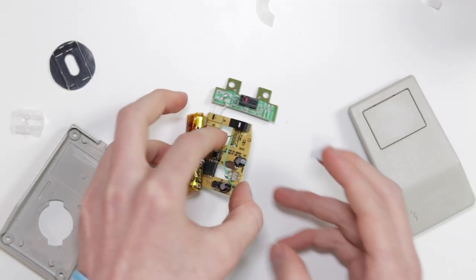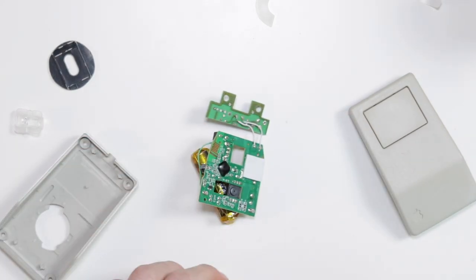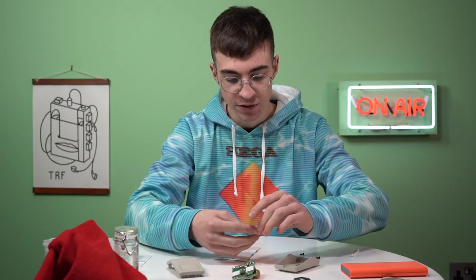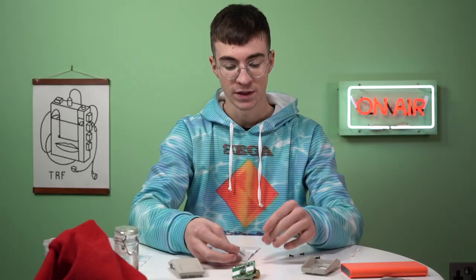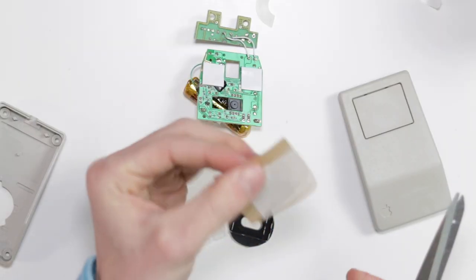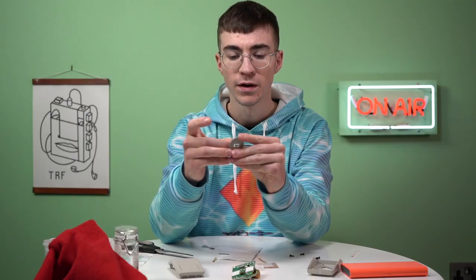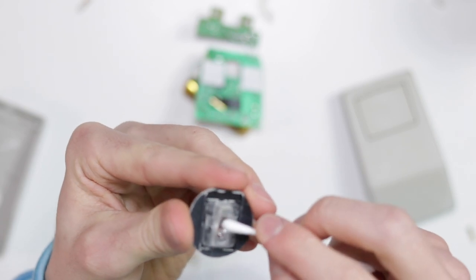The other ones we're going to have to do are the bottom of this motherboard — I'm thinking one either side, maybe just like that. I'm going to stick those there and there, and that should actually be enough. We are going to need to adhere this little laser tube piece of plastic to the bottom of our disc. To do that I'm going to be using some 3M double-sided tape that comes with screen lenses for Game Boys — I'll just cut out some strips and stick them either side. I just don't really want to glue anything. There is our little laser, which is really cool, so I'm going to give that a little clean because I've probably got some fingerprints on it.